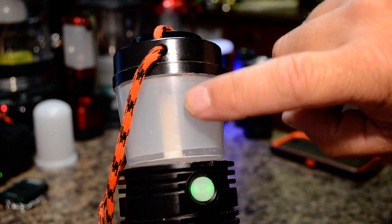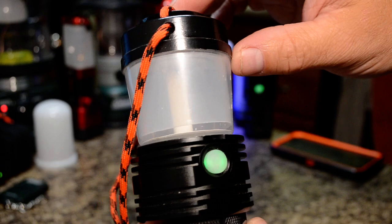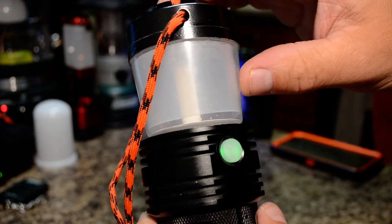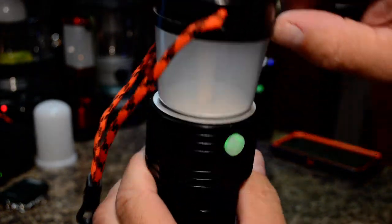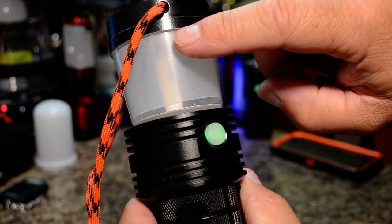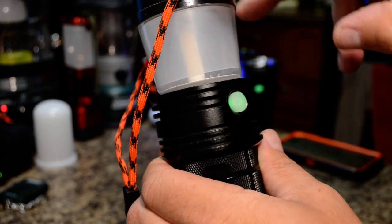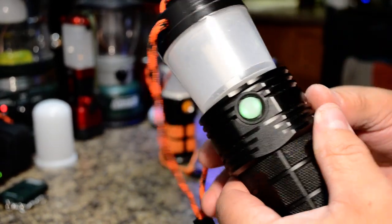The center tube is basically a sleeve over the bolt, roughly half an inch in diameter. The bolt is roughly 2.5 millimeters. What this center tube hides is not only the bolt but also the wires — in this case two leads going up to the LEDs on top. So there are no metal rods on the side with wires hanging outside to create shadows.